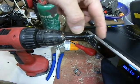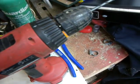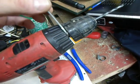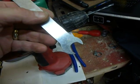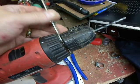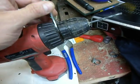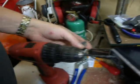A little bit of light tapping on the end of the drill. And finally I realised, if you look down here, there is in fact an opportunity to put a very narrow, thin spanner here. And it will drop into place, because there is actually a place for the spanner to go to take the chuck off.